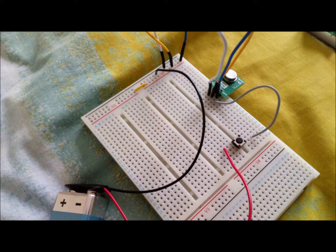I didn't have to use a white wire — it could have been any colour. The middle prong, the VCC prong of the transmitter, has a yellow wire attached to it. This wire is connected to the red section at the top of the breadboard. This is the positive section. That red thin line is broken into strips at the top of the breadboard, but there is a very thin yellow wire which is connecting those two red sections together.